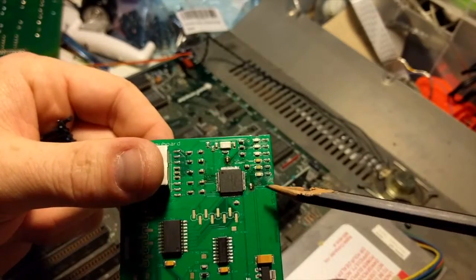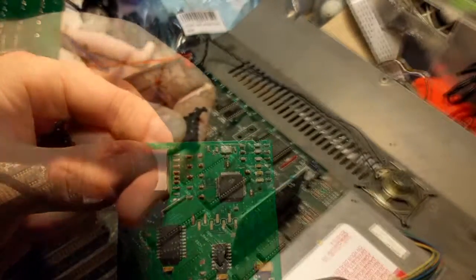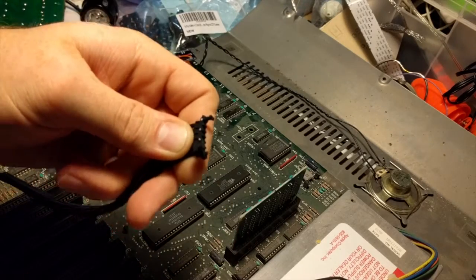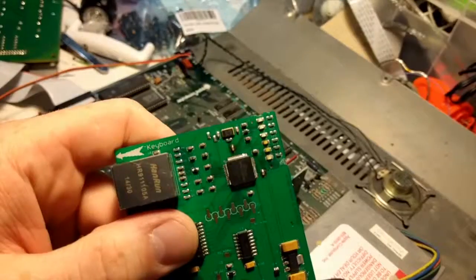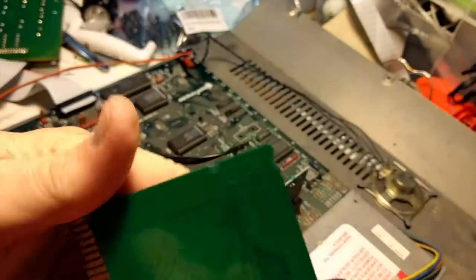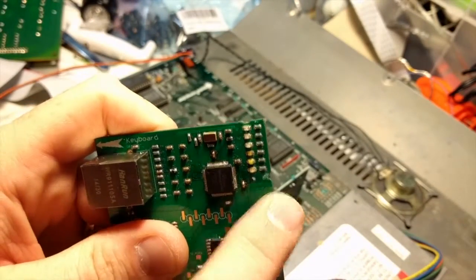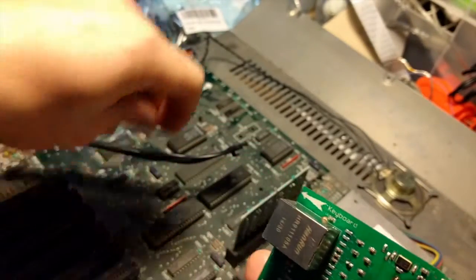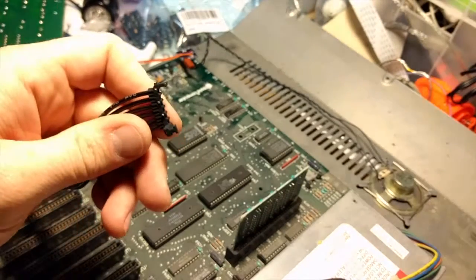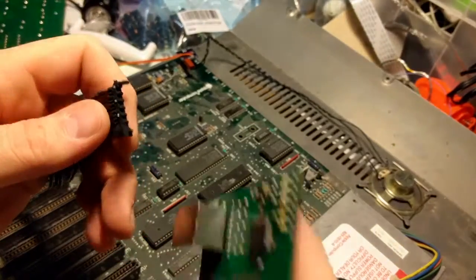There is a tiny hole on the UtherNet2 right below the LEDs, and there's a tiny pin on the corner of the light pipe kit that should go into that hole. Also on the edge of the UtherNet2 card there is a pair of notches — one here and one here — and those should line up with these T-shaped bits on the light pipe. So get all that lined up and pop it in place.